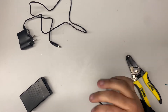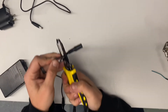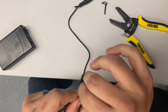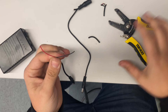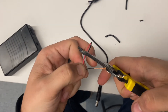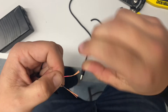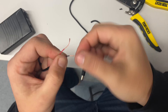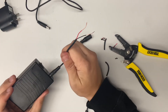So we're going to cut this and utilize the wires that are inside to power your board. We're going to snip the wires there to expose the two wires that are inside. Once you have those two wires, you can go ahead and strip those out. Now with these, you can connect your solid gauge wire or tin these and plug these directly into your breadboard. And that's how you'll get power from your battery pack to your board.